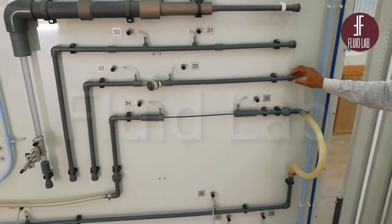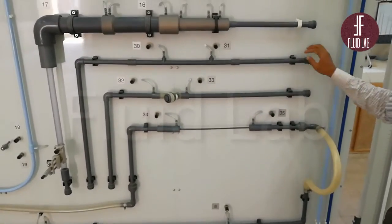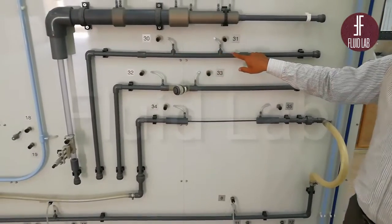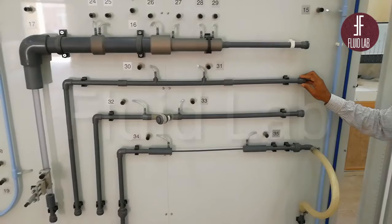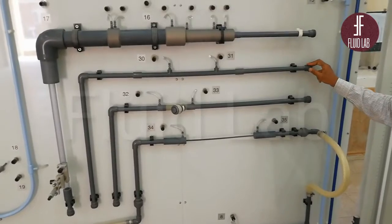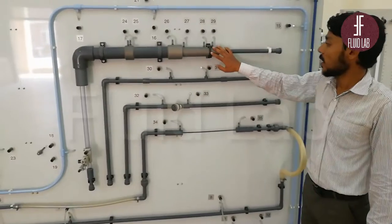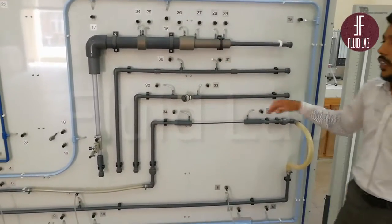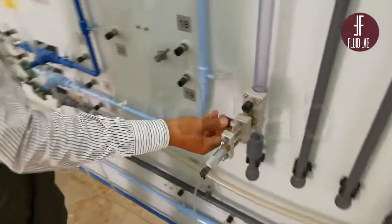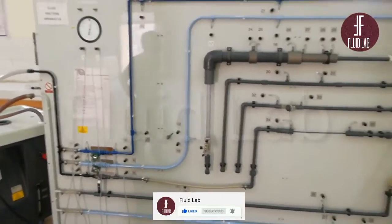Next, we have the grey circuit. This pipe is a rough pipe — it is artificially roughened and has a coating of sand particles. The diameter is given in the user guide and it is 0.5 mm. This is the last circuit — this is a venturi orifice. The internal area is a varying area, and along this way we put the static pressure head to measure the static pressure.